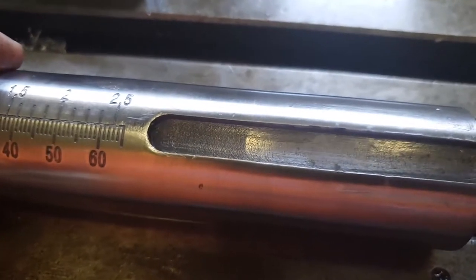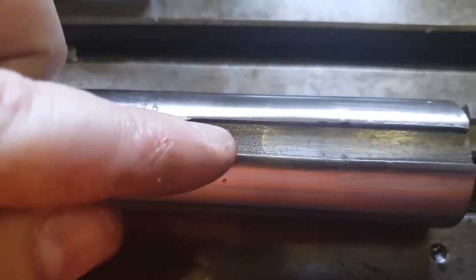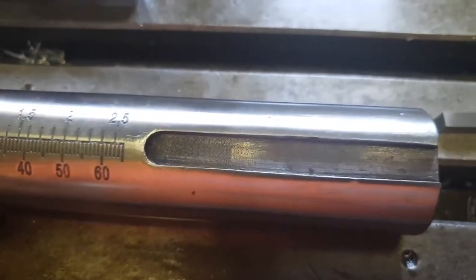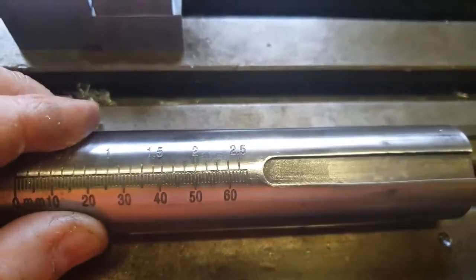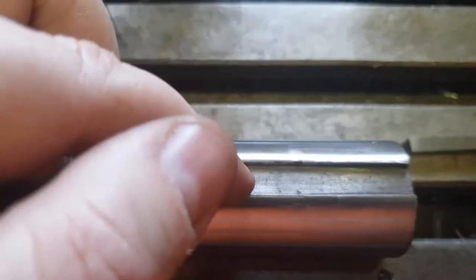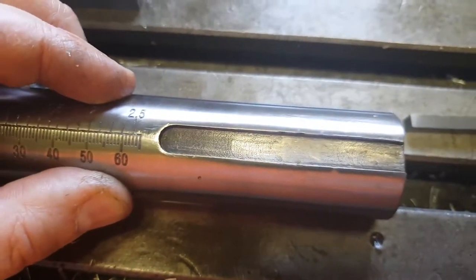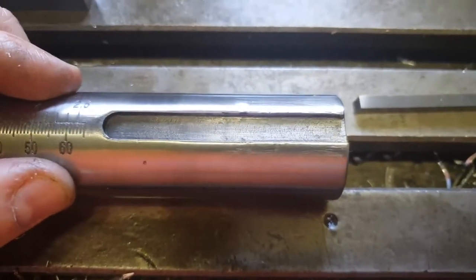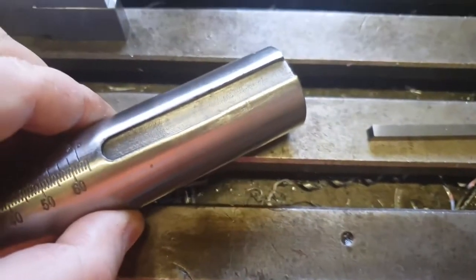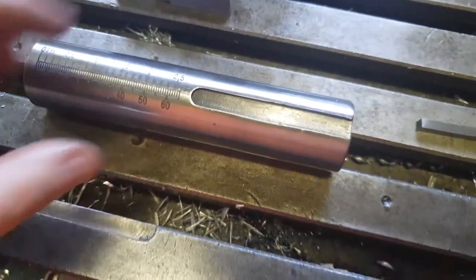It's been a long-term plan to get it fixed, and now I think I've got everything in place to be able to fix it. The actual positioning of the slot isn't really that critical. If the slot isn't aligned with any keyways, it's purely a grub screw pushing against this edge here. So I can probably get away with just the following setup — sitting it in the T-slots like this to make sure the slot is parallel to the bore.